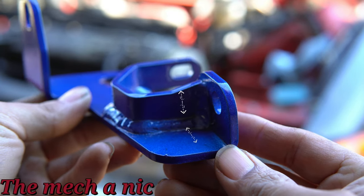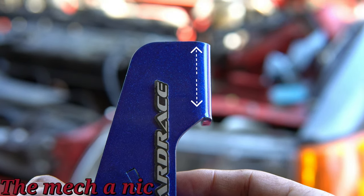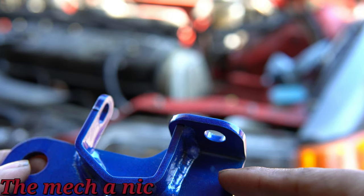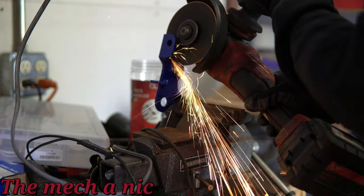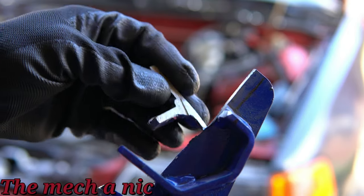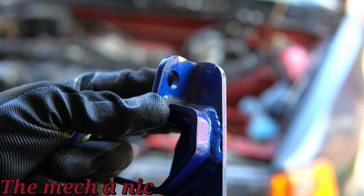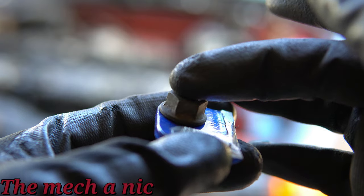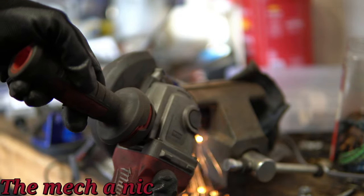The plan is to cut right here and just cut all the way across, then cut right here on top, and I'm just going to move this whole section inward to give myself a little bit more clearance. Essentially I'm just taking a chunk out and welding it back together. Unfortunately I have the world's crappiest welder — a Harbor Freight hundred-dollar unit. I know I'm a bad welder but I'm not this bad; it really is the welder, so I'm gonna put all my blame right there. It'll be enough to get the job done, it's just not gonna look pretty. The original design has two nuts, one on each side to tighten it up, and I want to go ahead and weld one nut on the back side to eliminate that.